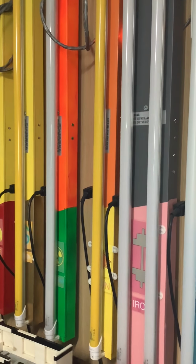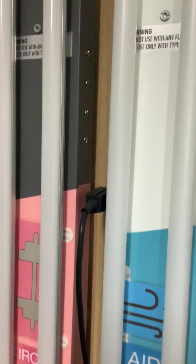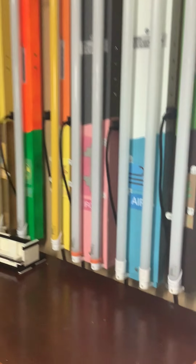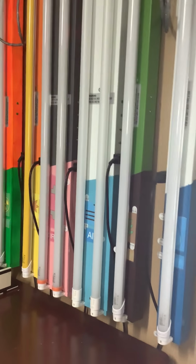Those are where the starter sockets are mounted. The starter sockets are actually hidden right underneath the plate and they sit up inside there. So to change them, you just take the plate off and then you can change them. So they're concealed starters. These Clevertronics battens have concealed starters as well. So to replace them, just undo this nut, take the plate off, put the starter in, and away you go. Now the older Davis battens were bored through, but all these newer ones are concealed.